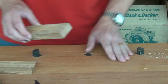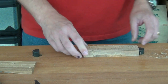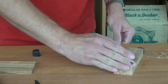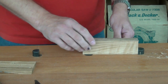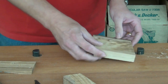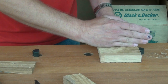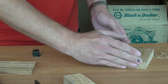A problem often encountered when using bench dogs — if we haven't held the work from the back — is that unless we're working with a force directly opposing the bench dog, there's a tendency for the work to rotate. If we've got very narrow work, that tends not to be a problem. But the wider we go, for example this piece, if we plane directly at the bench dog that's fine. But if we try to cover the whole width of the board, this side will rotate one direction and the other side will rotate the other way.